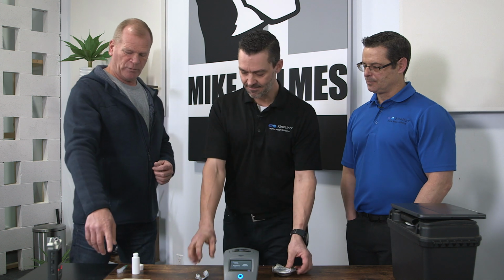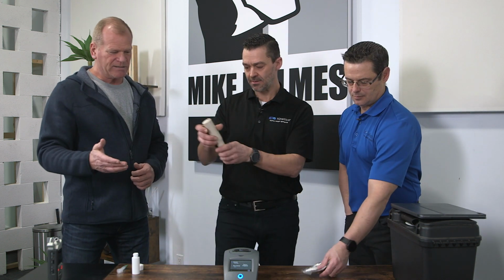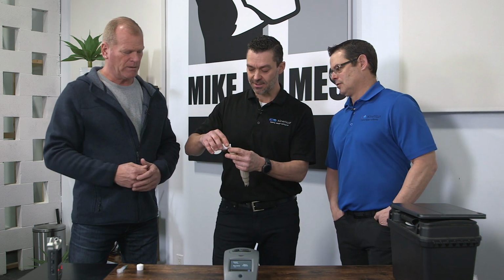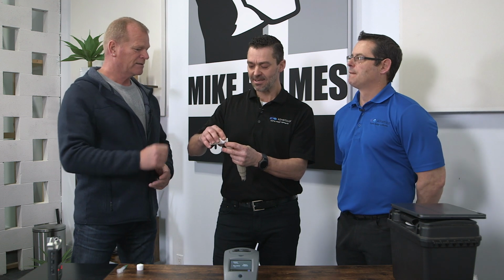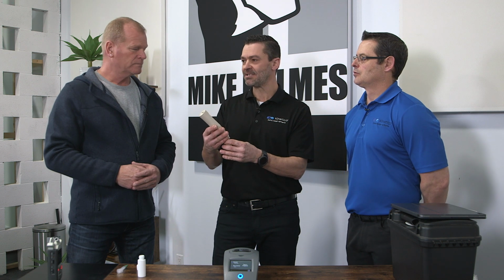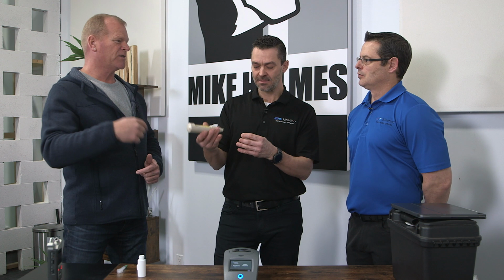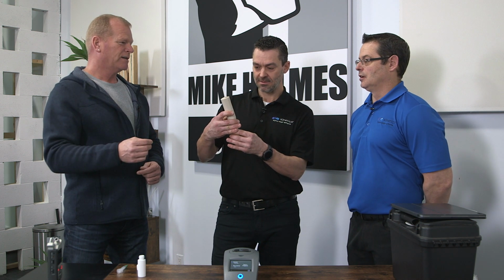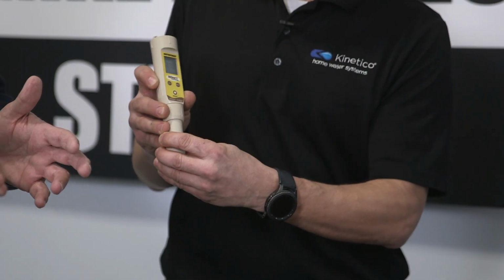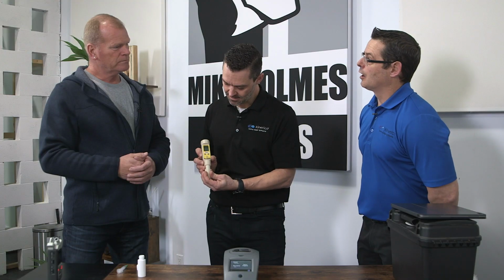At the same time, we're going to take the TDS meter. We can do that in the meantime, actually. Which is going to tell us the total number of TDS. Yeah, total dissolved solids. See, I said salts, total dissolved salts, but it's solids. It's basically a measure of all of the minerals and such that the water has dissolved on its way to your well. But in essence, it's salt. It's probably made up of calcium, magnesium. In wells, that's where a lot of the hardness comes from.